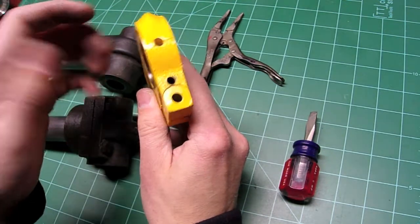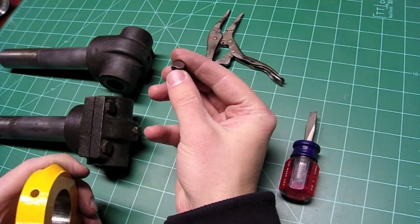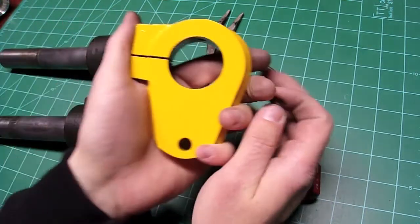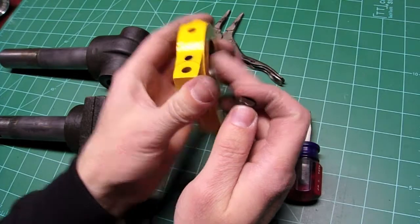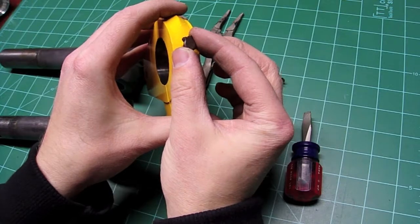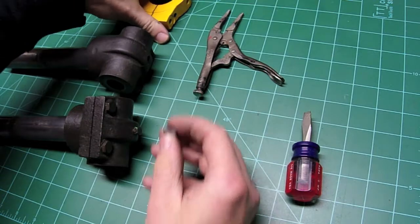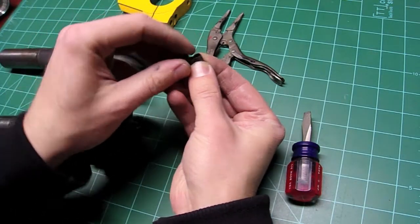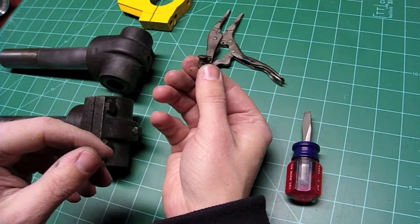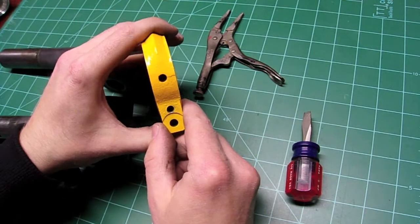One of the problems I had initially, when I was dismantling a lot of these parts, taking the bolts out and cleaning it all up for powder coating, was the oiler caps. The uprights have oiler caps in them, and the cam presses which attach to the shear itself had little oiler caps pressed in them too. They're about 1/4 inch, and they were the press-in variety. These little oiler caps have spring-loaded lids on them. You just put a little bit of oil in there and the lid keeps most of the dirt and debris out. But the problem I was having was pulling them out so I could clean them up.